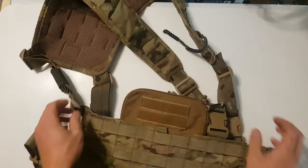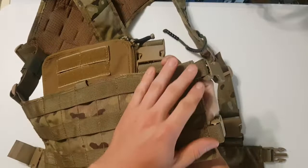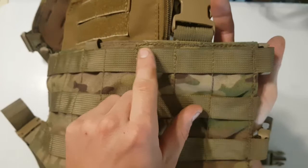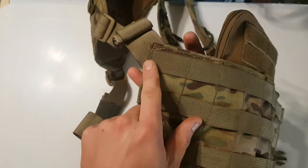When we closed the rig back up we used a standard single-needle lockstitch walking foot sewing machine, then came back with an electronic programmable tacker and tacked all parts of the rig exposed to high wear or high forces.